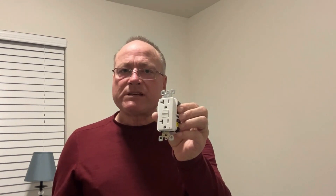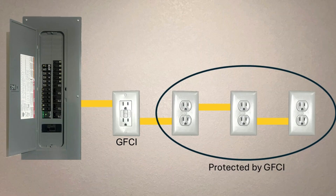You'll typically find GFCIs in areas that can potentially be wet: kitchens, bathrooms, on the exterior of the home, in the garage, as well as a few other areas. The neat thing about a GFCI is it can protect receptacles that are wired to this one — basically receptacles that are downstream of this receptacle. So if you ever mysteriously have a receptacle or multiple receptacles that are dead, you might want to check if they're tied onto a GFCI and that GFCI might be tripped.